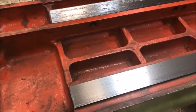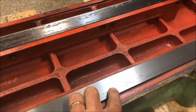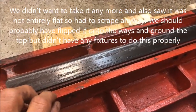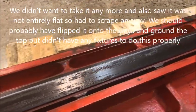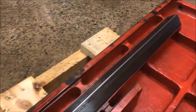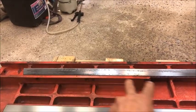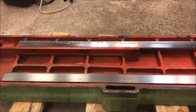The way to grind. As you can see, it's taken down six hundredths of a millimeter. Still some scoring left, and worse here. However, to avoid the problems with the gearing and the manual rack feed, and also to avoid taking it too much down, I think the owner decided to leave it as is. Possibly we can take it up to a tenth of a millimeter. But anyway - ground one part, then flip it over, and then ground the other - flip the wheel over I mean - so ensuring that you have alignment all over. That would have been trickier of course, with more setup and more time, if I should scrape it.